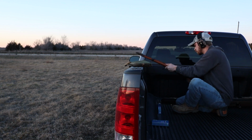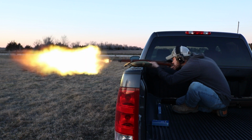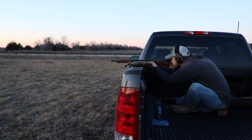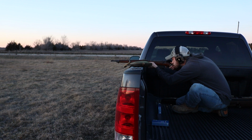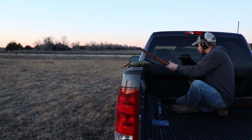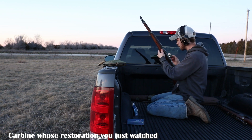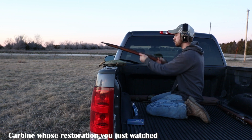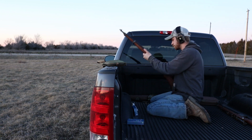You can see in each one of these clips the significant muzzle flash. That's because these cases are not technically the correct caliber. All they are doing is fire forming the brass to the chamber of the gun. This will make reloading 8x50 a lot easier. Now there should be some new commercially made 8x50 Mannlicher coming out. I find it easier to just reload. It's always going to be more accurate to load yourself, and if I have the brass already, why not?